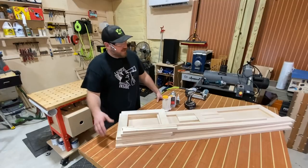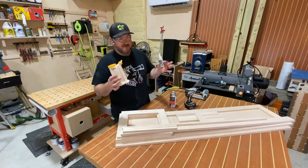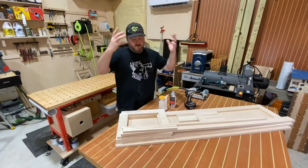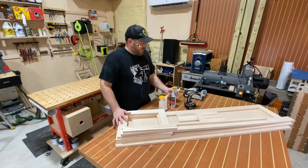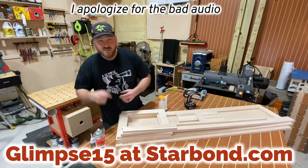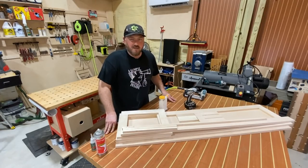So time to put this together. This is the fifth one I'm going to do — I've already done four but I'm going to show you how I'm doing it. I'm using regular glue and CA glue, and I really love this combination because the CA glue and activator act as a clamp while the regular glue, after about an hour or so, is what's really holding it all together. I'm going to use some screws for reinforcement and a nail gun. You can basically put this thing together with just glue and screws if you want to. But if you're interested, I've got a coupon code — this CA glue, the medium thick variety from Starbond, check the description down below, save 15% with my code GLINCE15. A lot of people use this code and swear by it as a tool in their shop. So let's assemble this thing and put some things on the wall. Let's go.